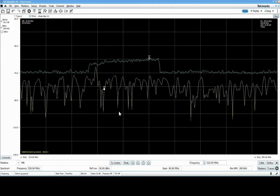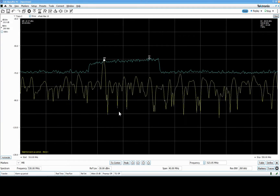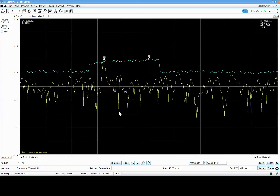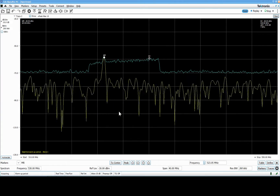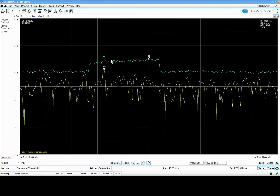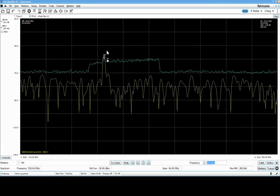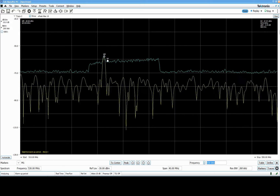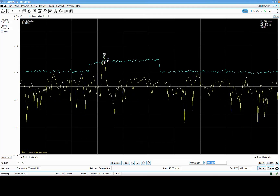You can see the sweet spot should be over here. Moving the sweep and you can see it's not tuned — that's the reason I didn't bend my antenna yet. I'll place the marker over the top now and bend my antenna more and more. At one point you will see a difference. Going forward with the measurement, I have M1 placed where it was before.